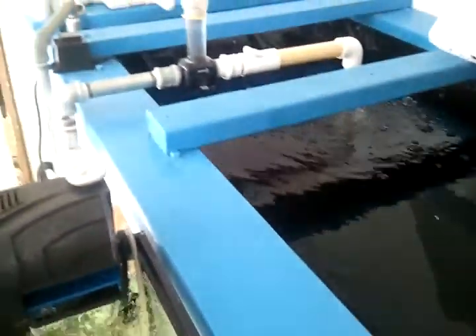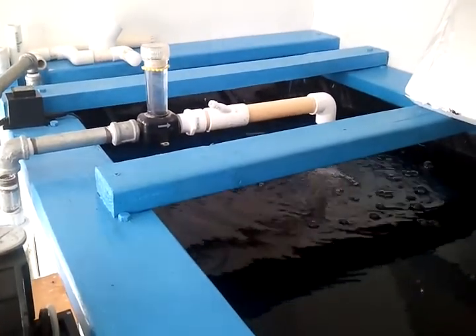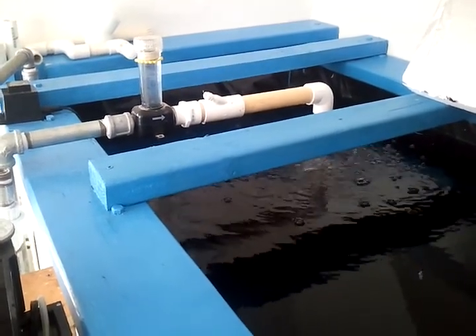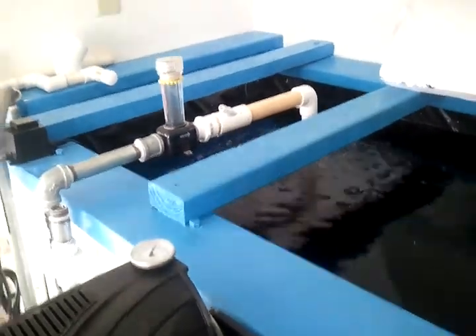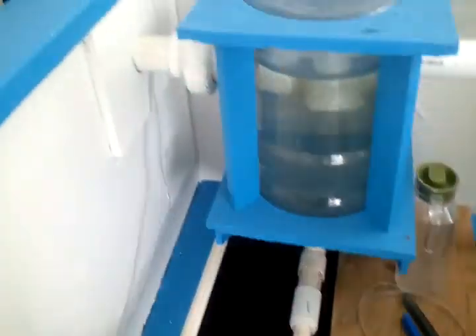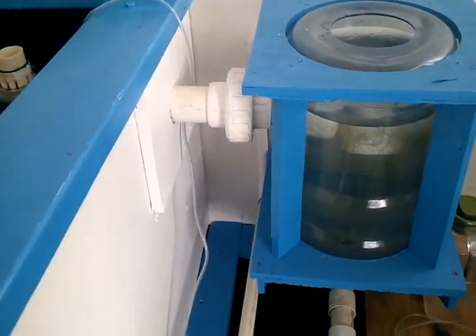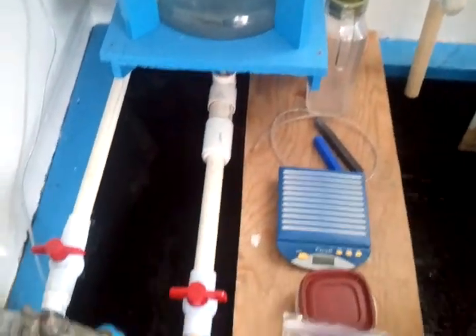So what I've got going on here is a pickup tube that goes down to the bottom of this tank. It's an 800-gallon tank. Got the water coming in over here — that's a flow meter on top of there. The flow rate is probably about 500 gallons per hour, though it's a little underrated; I think the meter only goes up to 250 gallons per hour. The pickup tube picks up water and debris, and then the overflow comes out into this spin filter that I built. The spin filter can be emptied with this valve here, and it flows into my drain.